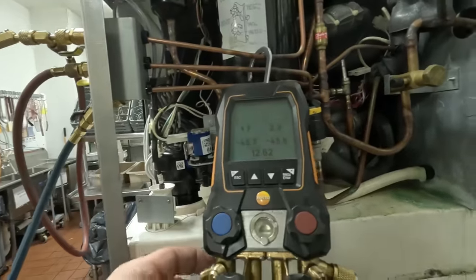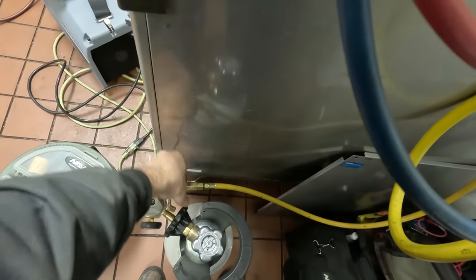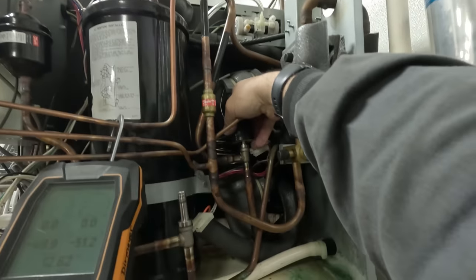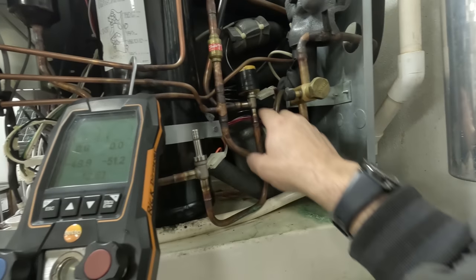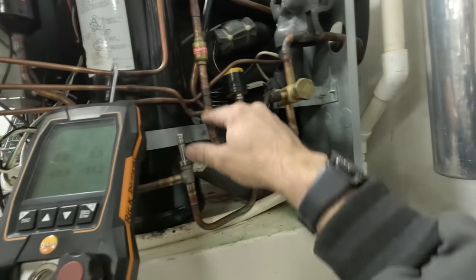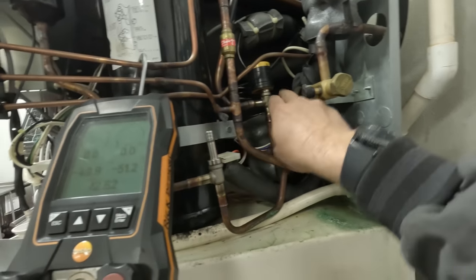We are in negative — which I didn't want — there we go, now we're up to a pound or two. Now we can release and let the pressure bleed off. What we're going to do on this is just bleed some nitrogen through it right now, that way we can unbraze it and then rebraze it back in after bleeding nitrogen through it.